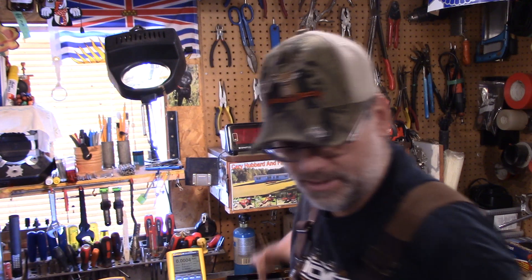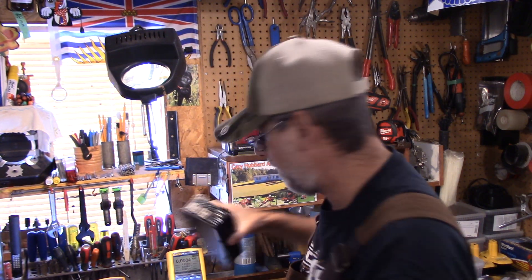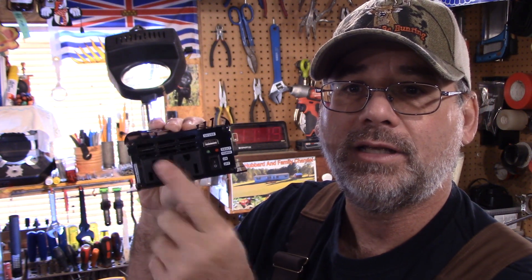The main question I want to answer today is: is it possible to join the two ports together in one outlet and get the full capacity out of your inverter? I'm saying no, you can't do that, and I can explain why. I've got a little setup here where I'm going to show why you can't do that. I used this heat gun — 230 watts max and 150 watts minimum — and this 300 watt inverter would run on the 150 watt setting, but on the second click it would trip the breaker.